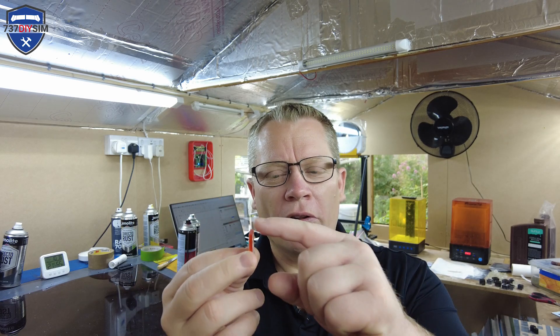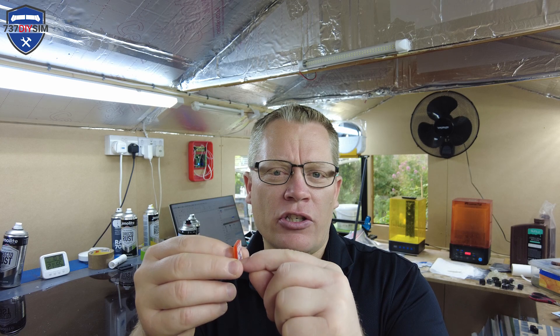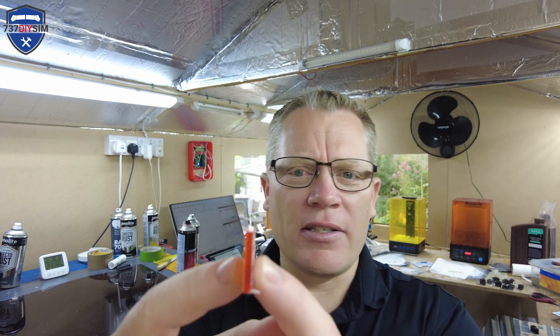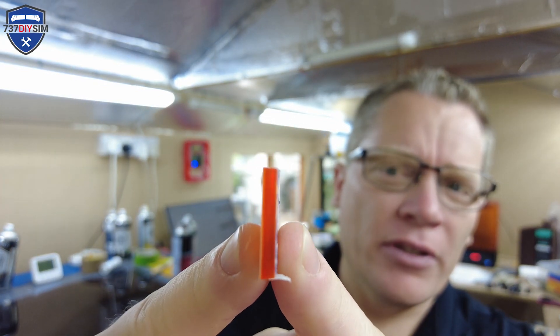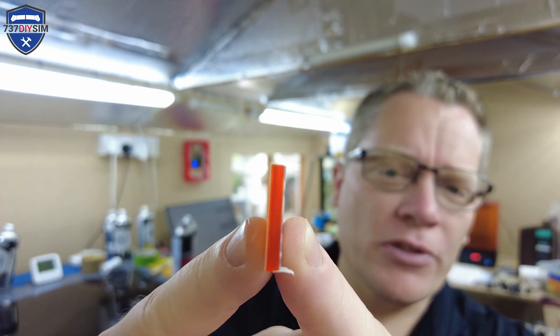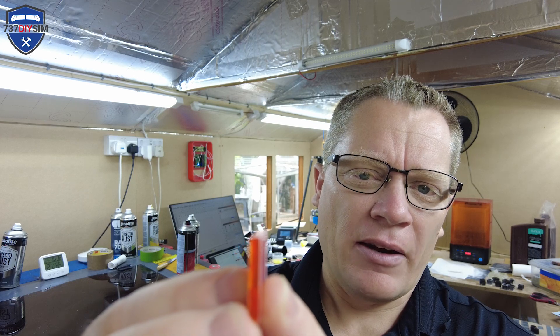Now these are version 4 and they've got a few issues. One that doesn't really have a slant, and if the slant is there it's the wrong way on the edges, so when you push it in there's a gap between the edge and the forward face of the lens. I'll come a bit closer — there's about a two degree slant on that top surface but it's facing inwards when it needs to be facing the other way.